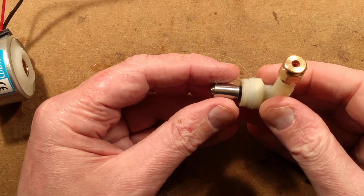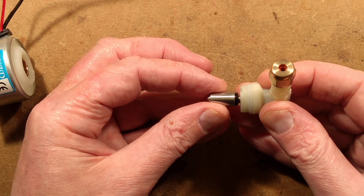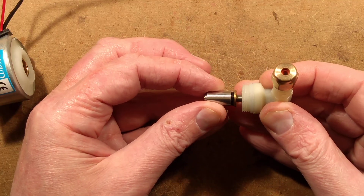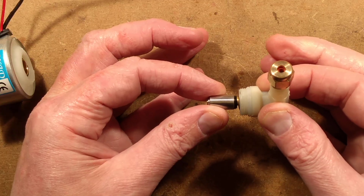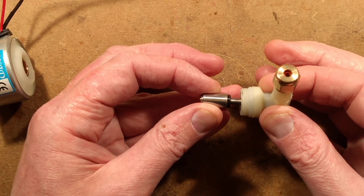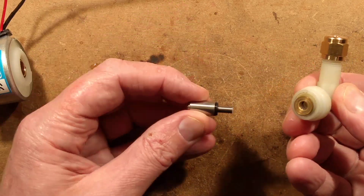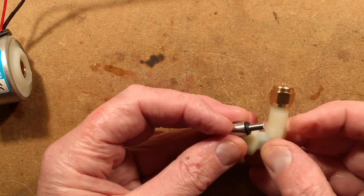Here is the problematic bit — this is the piston that gets pulled in by the magnetic force and then returned by the spring. On each cycle it's being energized, pulling out and then going back in again, vibrating very quickly. You can hear it making plunging noises. And we've got a little sealing plate here where it gets very wet.